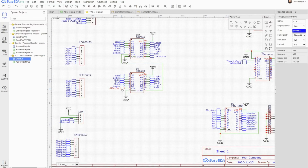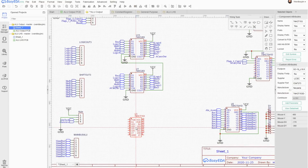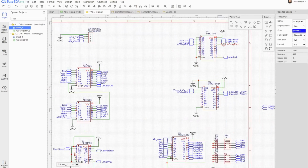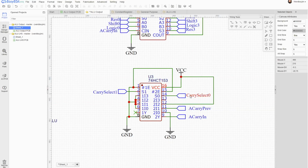Okay, so arithmetic carry in, that was generated by a selector. So the output from this is that arithmetic carry in. Now we just need to select the correct 4 input options for carry. First one's simple. Option 0 is 0, so that's ground. Option 1 is the carry flag from the last operation. Option 2 is a 1, so that's used for the increment ops. And then that one is also 0 because it's not currently used.